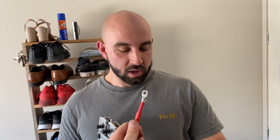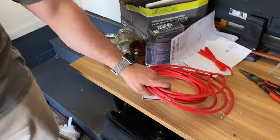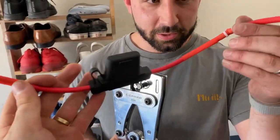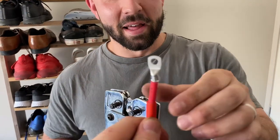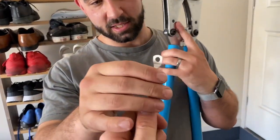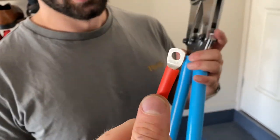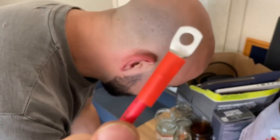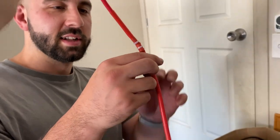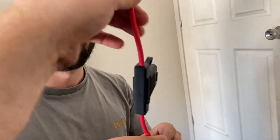We've got two more lugs on the longer lead that's going to run through. We've just popped it on after our first dodgy connection - we'll fix that up with some tape. The other ones are heaps easier - just pop that on. We've got this really big oversized crimper and we just crimped down - 6mm I believe it is. Pop the shrink wrap on, melt that down, and off we go. Much much better than the first one.